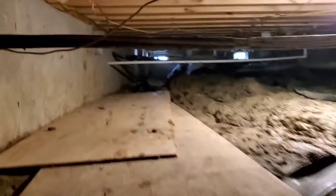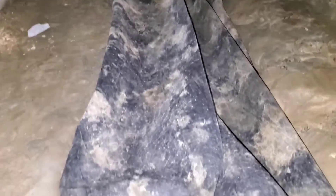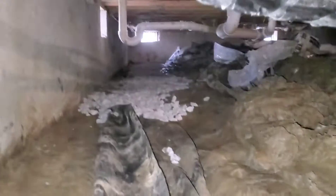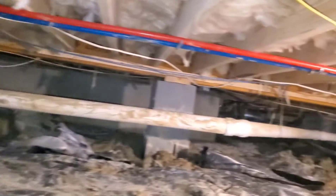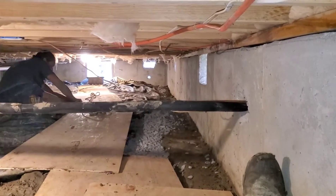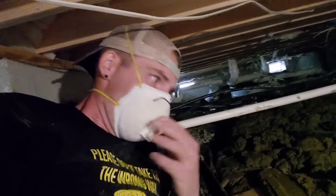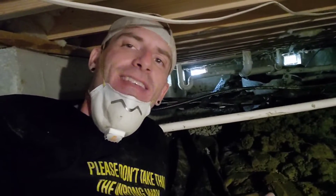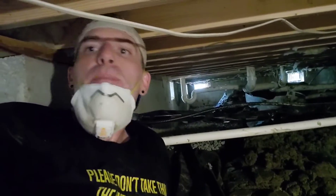Let me just show you where I'm actually working back here. Let me turn the flash on here so you've got some light. So you see the drainage fabric — notice I've gotten this completed all the way around, all the way over to the other side of the house. As soon as we finish this last little bit, we've got to continue making our way right down there towards the basin point. Once we get all that completed, this French drain will be completely finished minus all of our plumbing connections. We have to break away and head to Knoxville in the morning for my buddy Jacob. Looks like we're getting ready to pull a sled under here now.